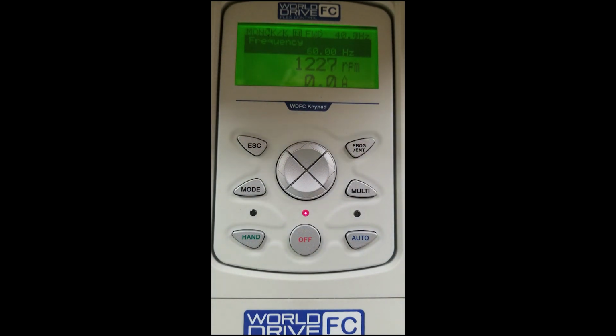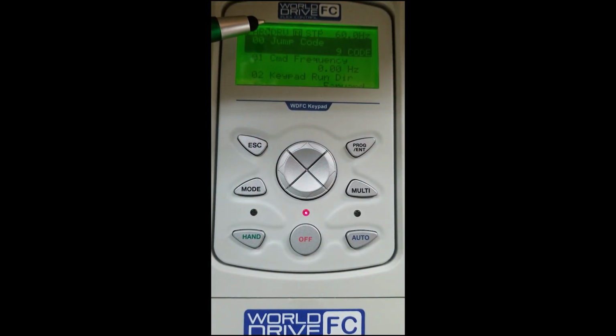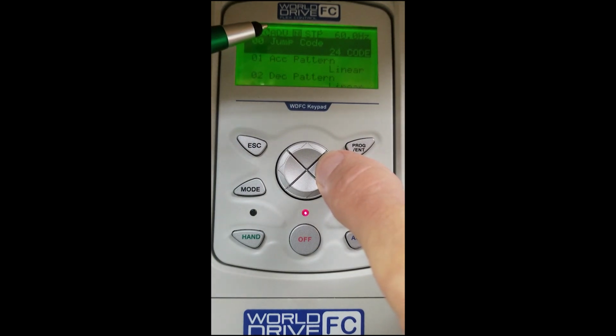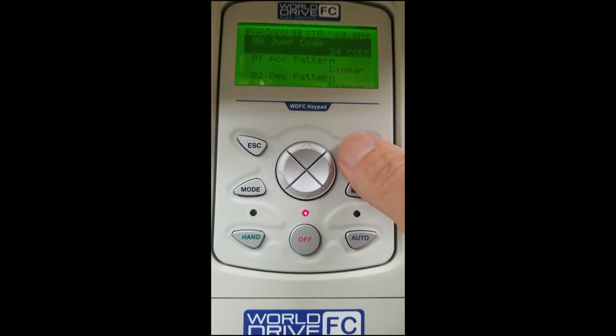As you guys can hear in the back, the fans in the VFD are running, so we're going to go and make a change to our parameters. So now we will hit the mode button, and you will see the DRV parameters again. We're going to scroll over to our ADV parameters. Our ADV is our advanced parameter group, and inside this group we will find our fan controls. Please reference the manual for all parameters inside the unit.